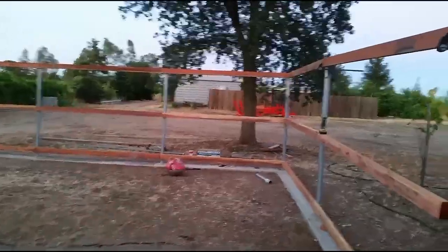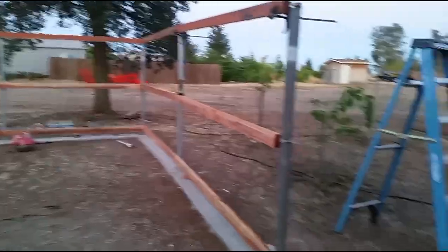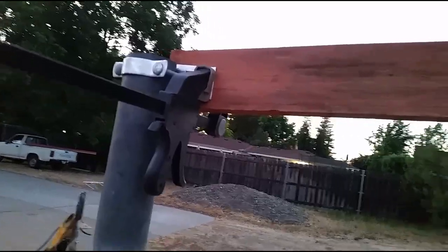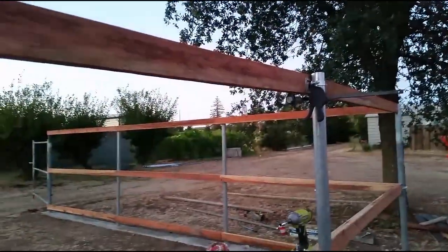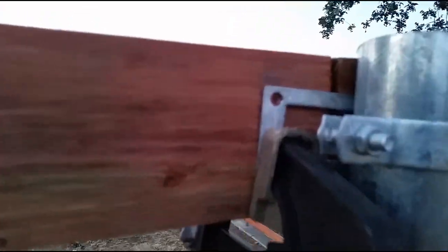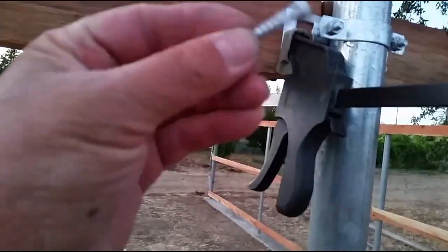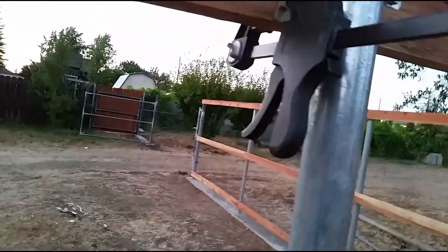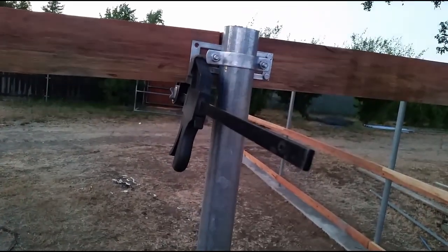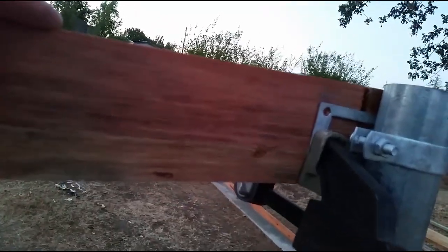So I got all my railings up, and how I did it is I use a clamp, and on both sides, since I'm working by myself, once I line everything up, I pre-drill a little tiny hole right there, allowing me to put this screw in there without cracking the wood. The reason I put it that high is that I'm gonna have a cap on top of it. This way, this will support the upper cap,